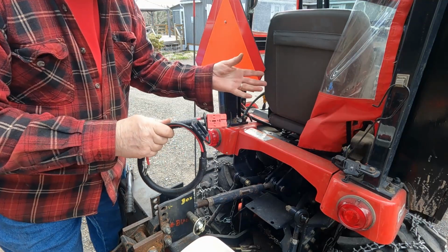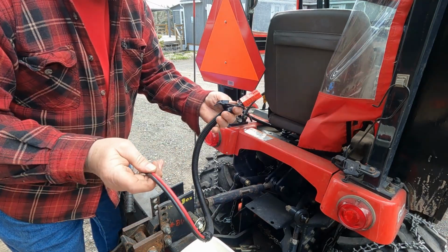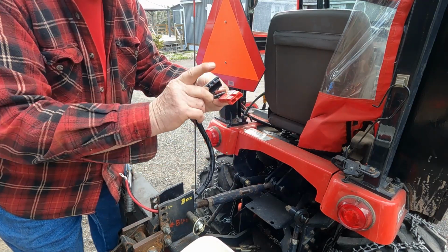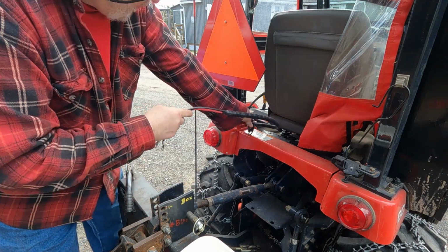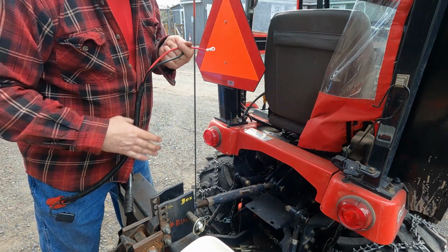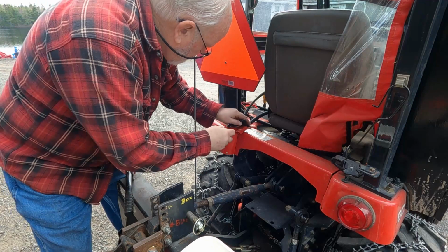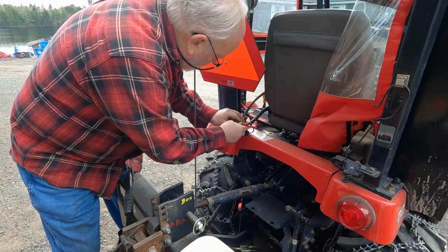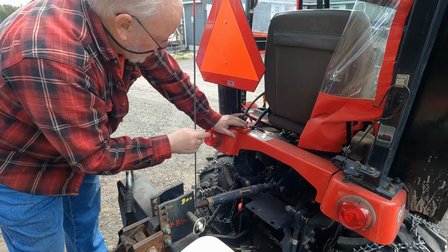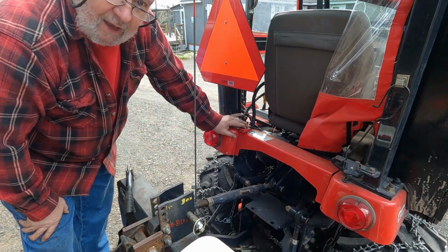When I made up the external battery connection cables for my tractor here, I made up these short little jumpers. I ended up not using those. I put bigger plugs on here for the ones that I used. So anyways, I had this one. So what I'm going to do is I'm going to put this one in the tractor. And I'm going to try to locate it right like that. So then that 12 volt supply will be at the rear of the tractor. I drilled one hole in here already. So I'm going to fish that through there. The bolt down through here and there, and I'll get underneath and bolt those up, and then that'll be my 12 volt connection, and then I'll just connect this end of it to the feed that comes from the controller in the cab.